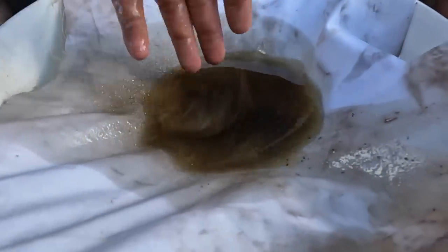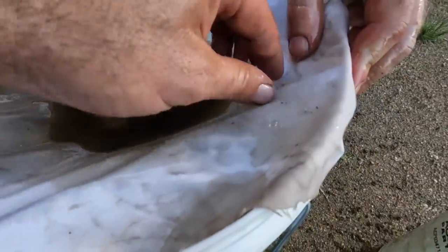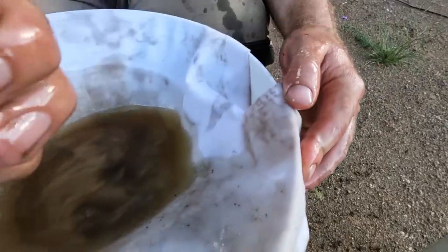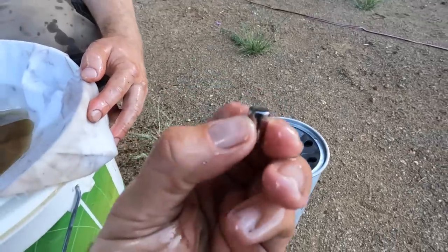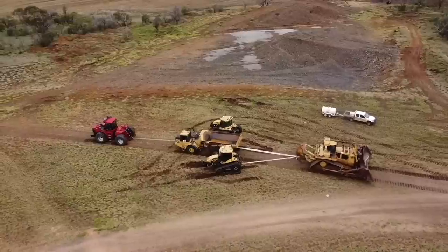First things first, there's a lot of brass material in that. That's all the oil out of the filter, so you can see that. A bit of hard facing. I think it's hard facing. Is that hard facing or a bit of brass? Well, no, that's brass. But the bigger issue is this part of a bearing came through, was in the bottom of the filter here.